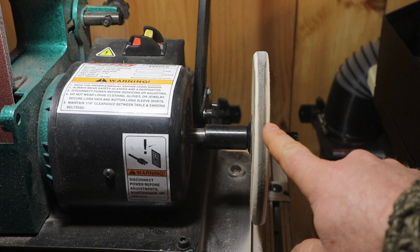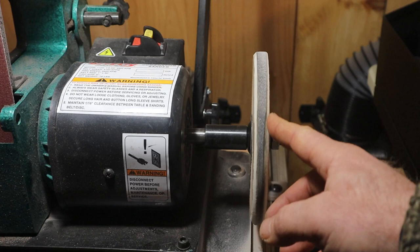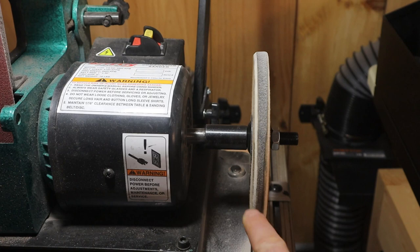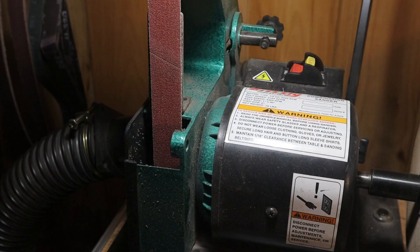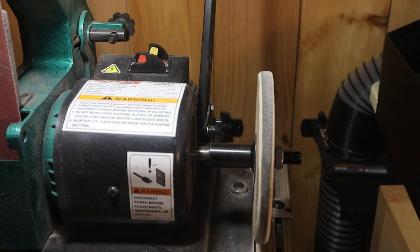Just to finish what I've done: this is a medium felt wheel and you can see there's something on there — it's reel mower lapping compound. It's sold at 120 grit, but it breaks down when used and it flies off too, so be careful. I use this and I've found that using the corners works well for me. I'll take a pair of pruners — like the cutter from a pruner — refine the bevel here, and then I have another felt wheel I use too. I've taken pruners and loppers through a really quick process by having this on here, and there's so much more you could do.